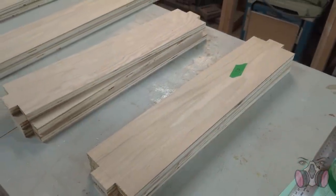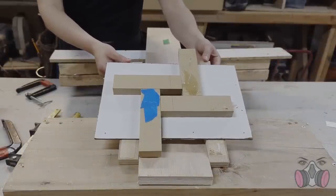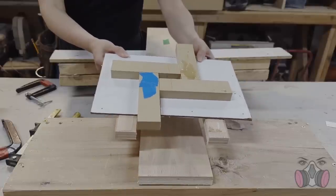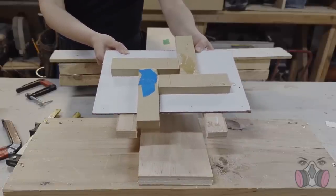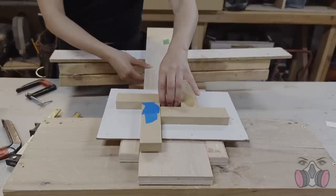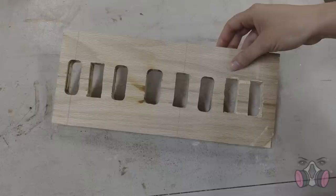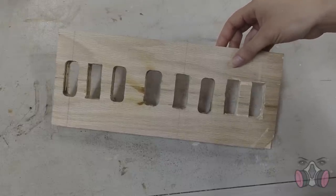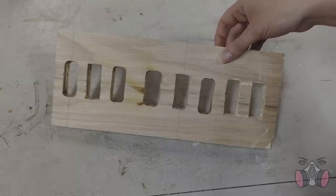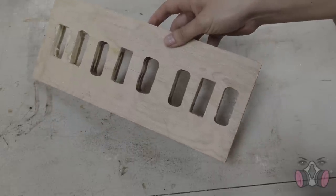To make sure I didn't screw this up, I created a template. I did this by cutting out a hole in masonite using the dimensions of the tenon, and then gluing extra bumpers to it so the router bit really doesn't have anywhere to go. I then glued guides on the side so I can move the template around and know I'll always be in the center of the piece. I also made sure to test out different approaches for the mortise, and I had a lot of fails before I found the right one. I tried different methods for cutting out the corners and making the hole into a rectangle, but no matter how I did it, I couldn't get a super clean edge. Normally this doesn't matter too much for this type of joint because the tenon usually doesn't go all the way through. But in my case, since I'm having it come out on the other side, those lines really have to look super crisp, otherwise it'll look janky.